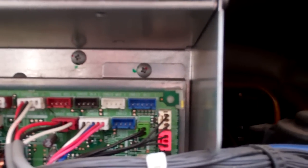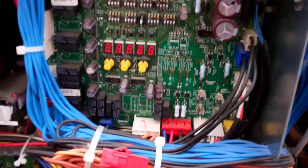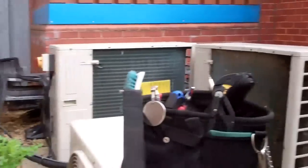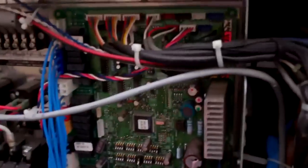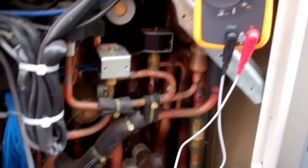The other two are thermistors. Just find the switch. It's dead now. It's a three-pipe system for heat recovery — quite a nice install, really. Alright, let's get a multimeter. Test leads in there. 35.8 kilo-ohms. And what does our chart say? 35 is going to be... it's getting up for 30 — it's not 30 degrees, is it? It's stone cold. I don't think it's been trying to run.